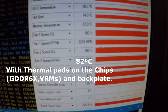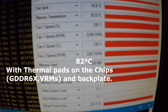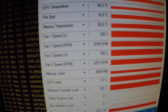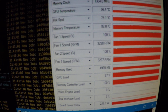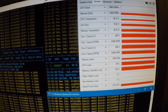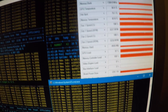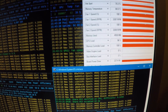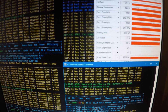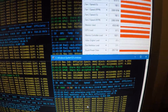I'm getting these results because I placed thermal pads on the opposite side of the memory chips, and also on the opposite side of the VRMs — the electrical stabilizers that supply power to the circuit board. That has made a very big improvement. I've seen other guys talking about it and decided to give it a try, and yes, it's totally worth it. If you're opening one of your cards and it has a metal backplate, put a thermal pad on the opposite side of the VRMs. It will help cool down the card, because VRMs run very hot and end up heating all the other components.